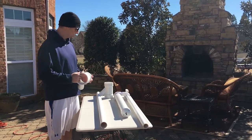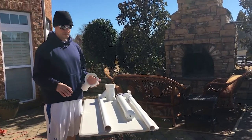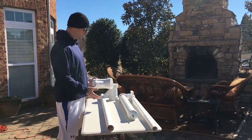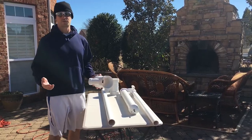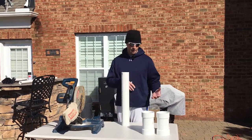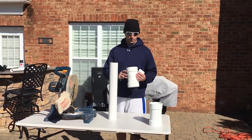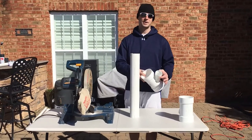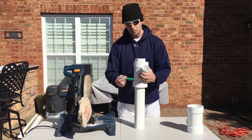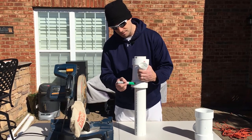For the next phase we need to put some kind of legs on this thing. I thought about putting actual legs on it with feet that sprawled out to the side, but since we're going to the beach, I'm going to make something that mounts sand spikes — they'll be interchangeable, so if we wanted to come back and put legs on it, we certainly could. The benefit is that when we remove the front spike, it actually doubles as a rod holder, giving us extra versatility. To make the connection that permanently mounts to the air canister, we've got some four-inch connection pipes that go down to a two-inch diameter in a Y shape, which will fit over the top of our air canister. We'll cut this to remove the excess material just outside the two-inch connection.